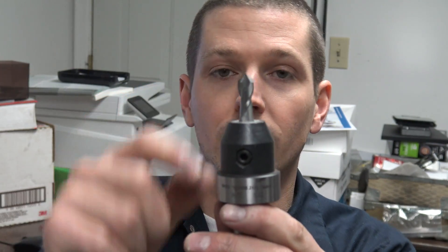One of the reasons it can do that, aside from being a good insert, is you're creating the chamfer with an insert all the way out here — so you've got much better surface feet per minute than on a tool where you'd have to be using the very tip, which as we know from the carbide feeds and speeds video series stinks. We also used the shoulder to clean it up and then came back to spot with this.